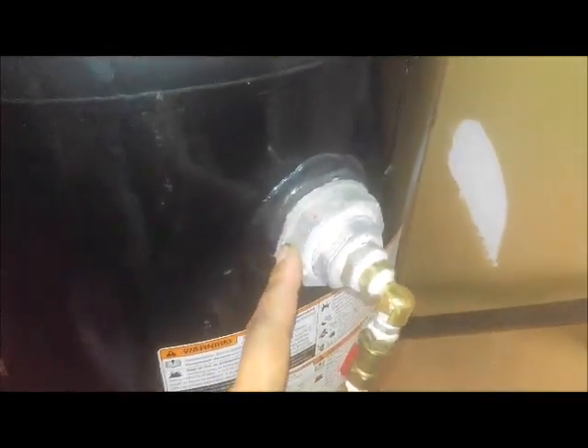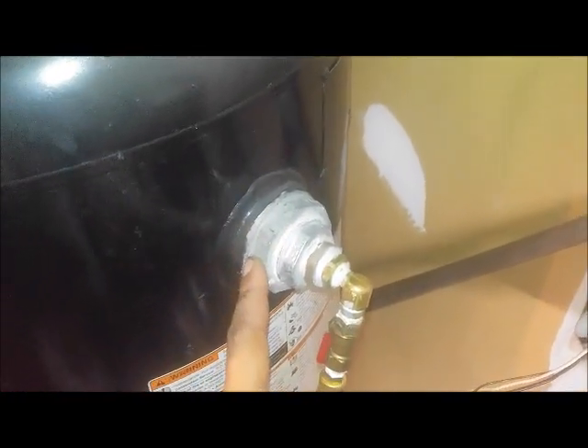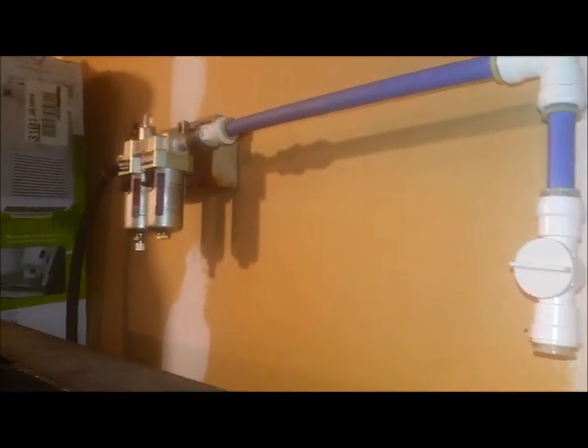And then on the other side, I had to reduce it way down from a really large size — it was a pain to find — and then I put a ton of actual pipe putty and tape around the pipe putty just to make sure it's a good fit on all of these different reducers. Then a 90-degree out of it, and then I have a ball valve to shut off my supply for my whole garage, and then a rubber line that runs up to my air dryers.